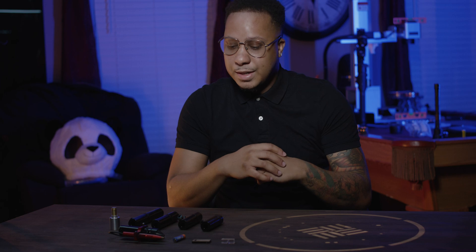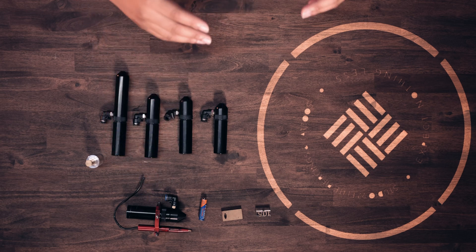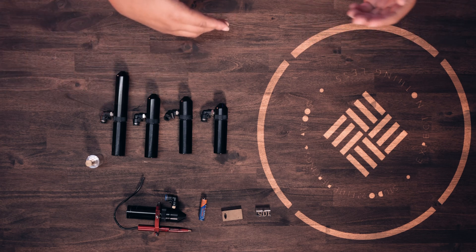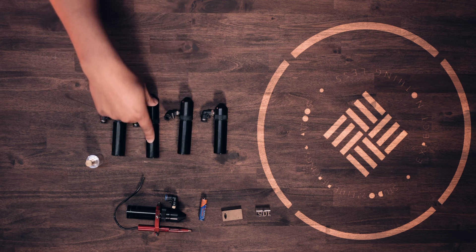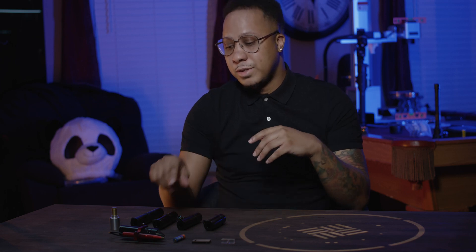Your choice, your machine, do what you want — just kind of my suggestion on that. Back to the American Photonics lenses: when they all focus at the same distance, it takes the guesswork out. If you get rid of that autofocus pin and the side-mounted red dot laser and use a beam combiner, these are a breeze to switch between — going to really fine engravings with your 1.5-inch, to your all-around 2-inch lens, to decent engravings with really good cutting depth on the 2.5-inch, to serious cutting depth on the 4-inch. This 4-inch and the 2.5 will reach all the way down in my 100-watt 30" bed and burn materials under the bed and possibly start a fire, so keep an eye out when you jump up to those bigger lenses.